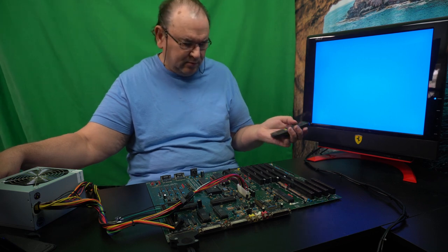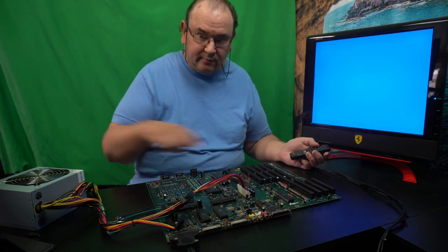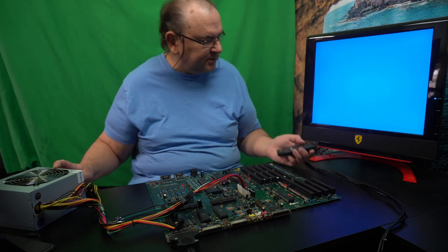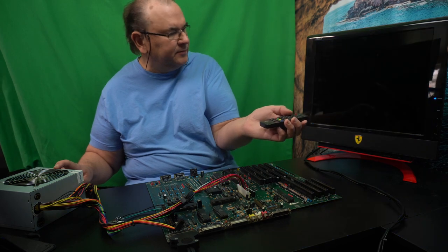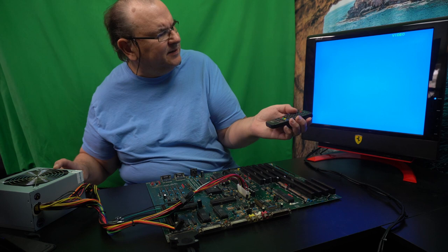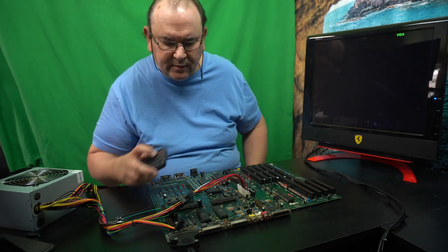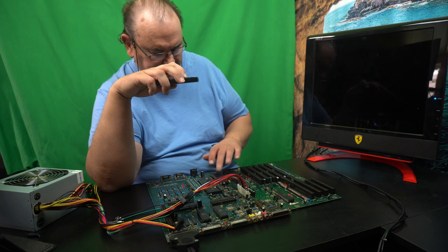Okay, no smoke. Still looking for smoke. That's the thing one is most concerned about, that there's an actual explicit short circuit. Now this would stop also if there's a power short circuit somewhere. So this is a normal PC power supply, so it would actually give up. Now, nope, doesn't seem to be any kind of a video signal.